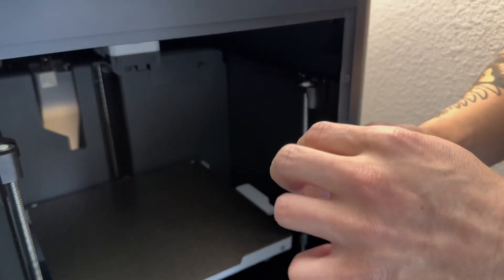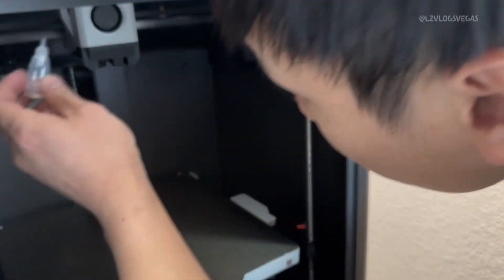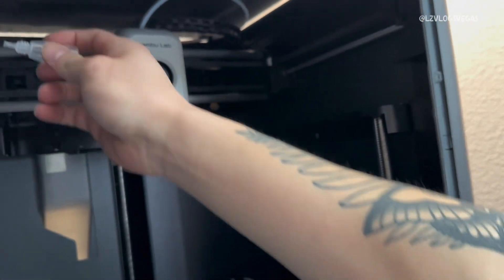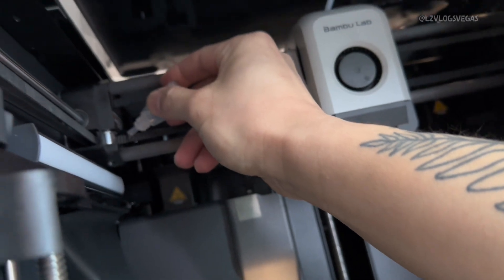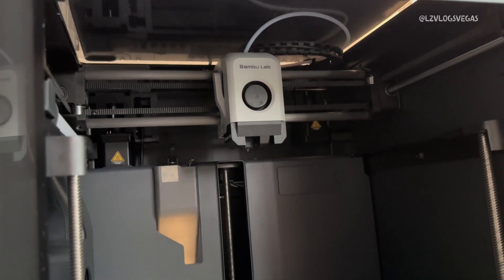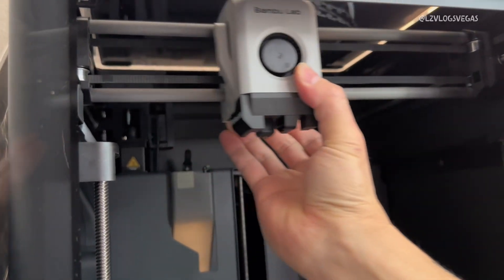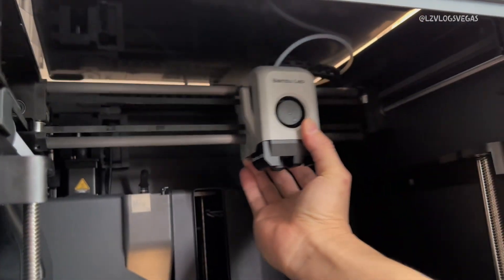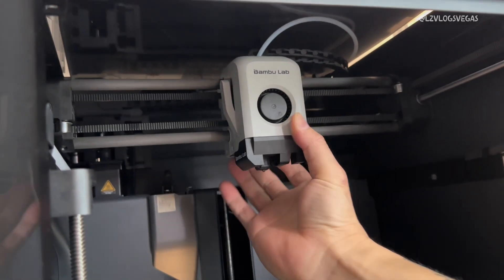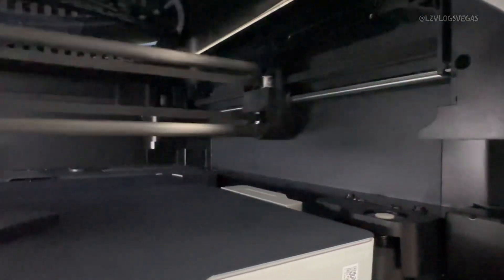Once you've got your oil, you want to dip just a little bit of it onto your belt — whichever part it was squeaking on. A single drop will do, not too much. Once you've done that, move your nozzle around a bit to lubricate the pulleys, and hopefully the sound should be gone. If it doesn't go away, keep messing around with the extruder and find out exactly where it's squeaking. It's like nails on a chalkboard.